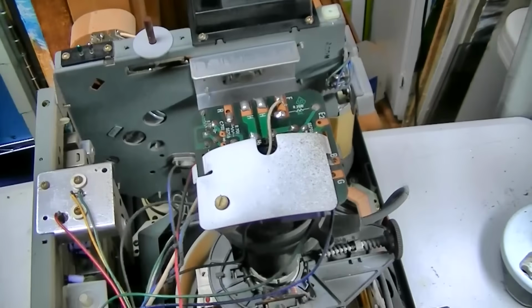I talked to the owner of the set, and he's totally cool with me just going through and testing all the capacitors and fixing it, getting it working, making sure there's nothing else. And I told him, listen, you can recap it if you want. We got a local parts house here. You just get the value and replace them. They're not hard to change. Very small learning curve in changing electrolytic capacitors.